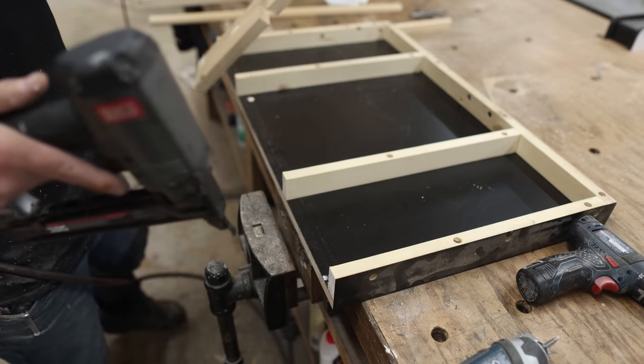With all my pieces cut, I can start nailing them to the doghouse. I'm putting them vertically and just butting them up to each other. This is why I had to put on that house wrap — even though the siding is super tight, I'm still worried that water could get behind it and cause damage over time, so that water barrier will definitely help and the pups will appreciate it.